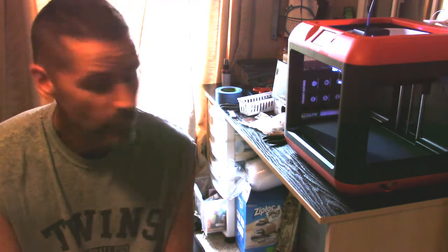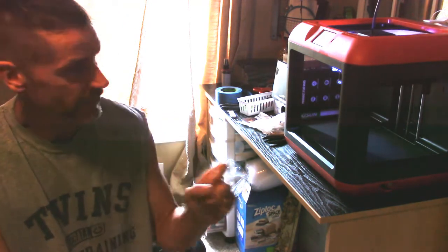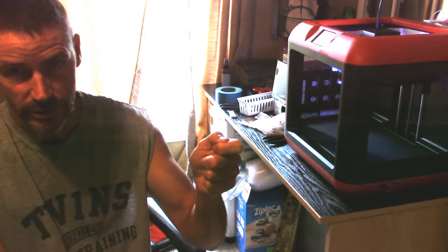When I first started printing, one of the things that annoyed me was oozing. What was happening was I would start to print and as the nozzle got to temperature, right before the print, I had this little string of filament starting to come out. I got around that just by some procedural changes — we're there with a little paper towel and just as it comes up to temperature and the head moves into position, I give it a quick wipe to get as much excess off the extruder as possible. Knock on wood, that's worked fine.